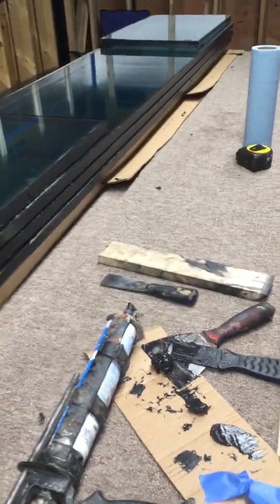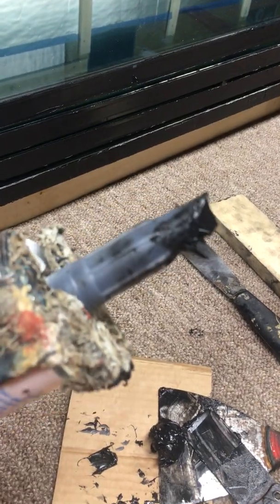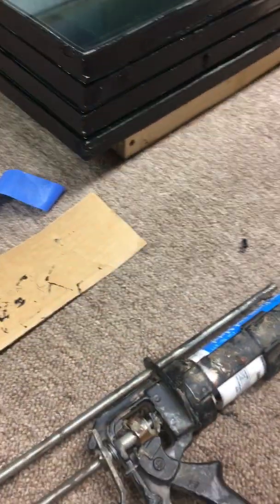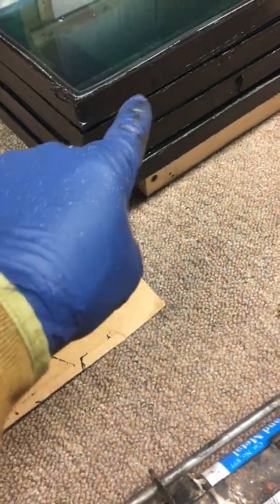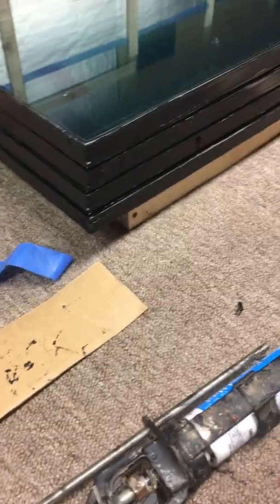We use just a little putty knife and we cut a good-size cut for the tube because there's quite a bit of filling here — that's five-eighths by three-sixteenths getting filled. One thing to know: I just don't stop at the corners, I roll around the corner so it doesn't drag it out, and that's pretty much it.